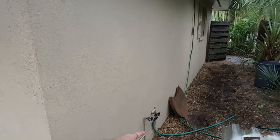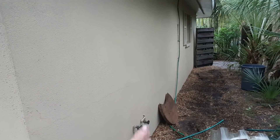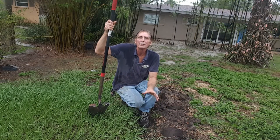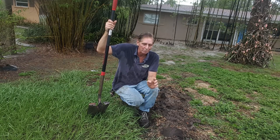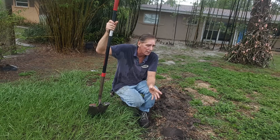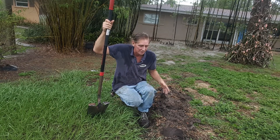Same thing on this side — you can see I started to pull some of this pea gravel back. There's not much here but pull it back, do your prep work first, and then you can easily trench right down through there. Out here at the street where the discharge is, remember this line is only about six inches deep, so it's pretty easy to do this yourself. Always work backwards through your yard — it's easier to dig it out and then come back and scrape it up.